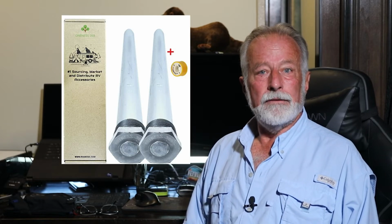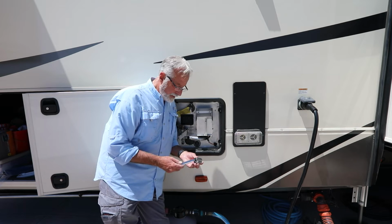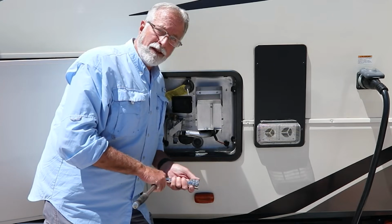So that we can begin our process, we are going to do the descale this time in a way that uses some cheap 3/4 inch PVC and two fittings, a 90-degree elbow and a threaded end, along with about a 3-foot piece of PVC that you can cut to size. We buy our anodes in a 2-pack from Amazon. The other things you'll need are a 1 1/16 inch socket, a 6-inch extension, and a handle in either 3/8 or 1/2 inch, a roll of Teflon tape, and 6 gallons of cheap distilled vinegar. It tends to have a lower odor. A little extension to be able to get it past the inset of the hot water heater, and my grandfather's old Snap-on ratchet wrench, 1/2 inch drive, and that should take care of it.